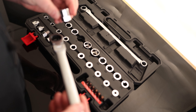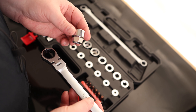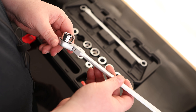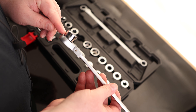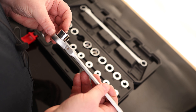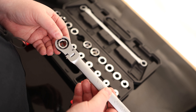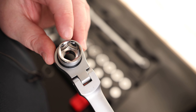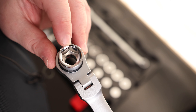And these will snap on very much the same way. This style looks a lot more like a nano socket, so you can see it is still going to clip in, but that is going to take up much less room than you would get if you had a 3/8th drive and then the socket sitting on top of that. So you can fit this still in much tighter areas than you would with a normal ratchet. It is also handy that that is hollow, so if you need to fit this over something like all-thread, you'll be able to do that. It does appear that these are all 6-point, which is excellent, and it appears that they are all drilled out on the corners, which is going to be excellent for off-corner loading.